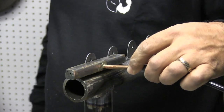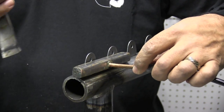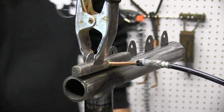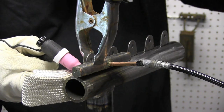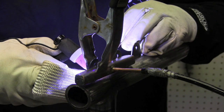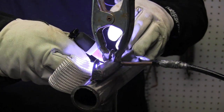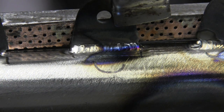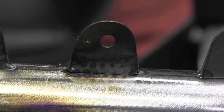The reason for the purge gas is that when you weld on something thin like these tabs — only about 50 to 60 thousandths thick — the back side is going to get all scaled up and then it won't weld good. If I get some argon coverage to the back side, it's going to weld a whole lot better. Also, I'm welding thick to thin here — the pipe is about 150 to 160 thousandths wall thickness and the tab is 50 to 60 thousandths. Leaving the wire in the puddle helps a lot, and directing your heat to the thicker section — that's always a rule of thumb when welding thick to thin.